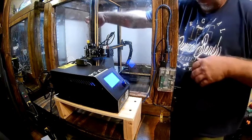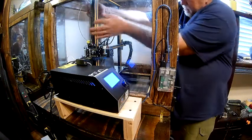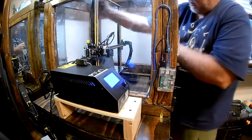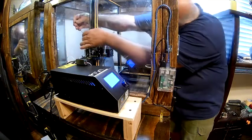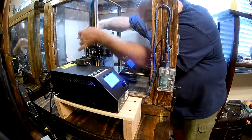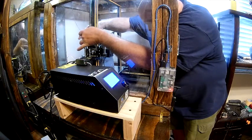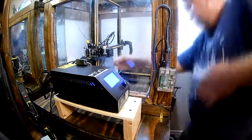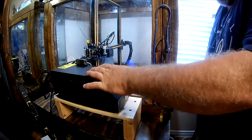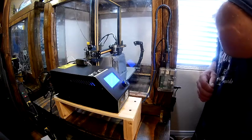It's backing itself out right now — it says 'Print Paused, Waiting for Filament to Unload.' The filament is out, the filament is going in. Get the excess off the nozzle. Press the button to continue. Resume print. And that was simple — no problem whatsoever.